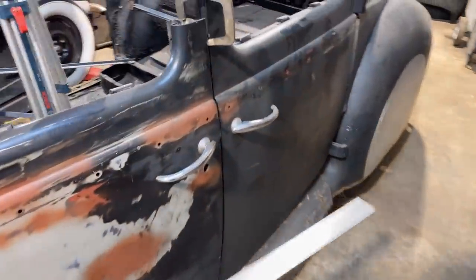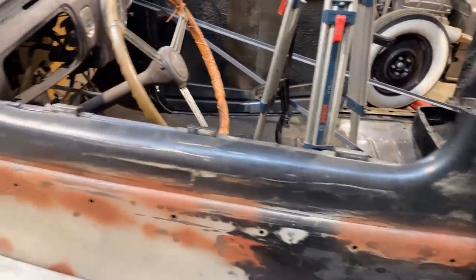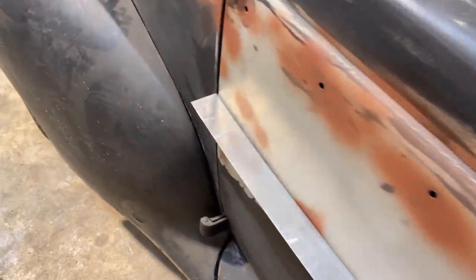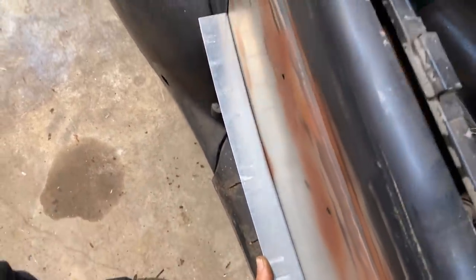Rather than shrinking a little bit along the whole thing and kind of guessing how much to shrink and where to do it, what I like to do is start at one end and I'll do a shrink and then I'll have a look down and see how close it is. And then I'll do another shrink, and then we'll slowly just work from one end to the other.